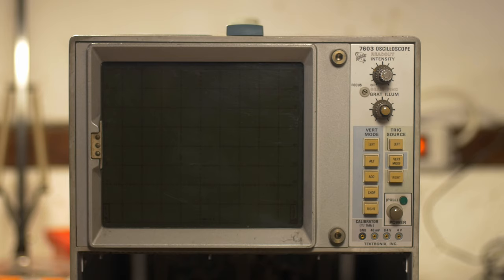That's great. Anyways, this oscilloscope has the option 77, which is the P7 phosphor CRT with the spectrum analyzer graticule on it, which is a great feature, because if I want to, in the future, get myself a spectrum analyzer plugin, I can. And I can actually read it on the display. And obviously, it can be used every day as the normal oscilloscope function. But with the graticule like that, I can use it also as the spectrum analyzer. Unfortunately, these days those spectrum analyzer plugins go for very high prices.